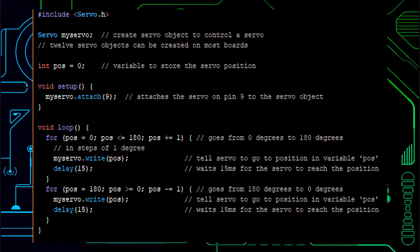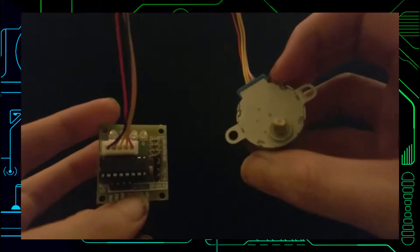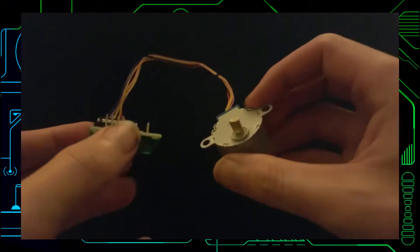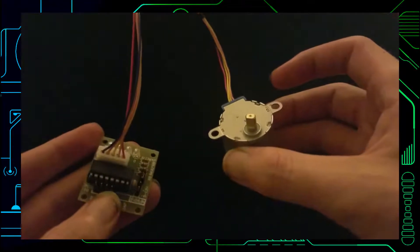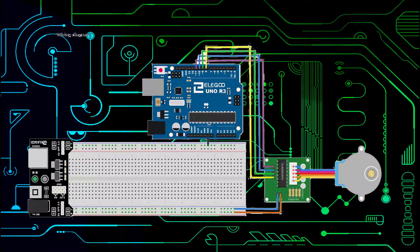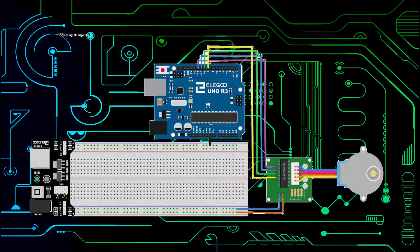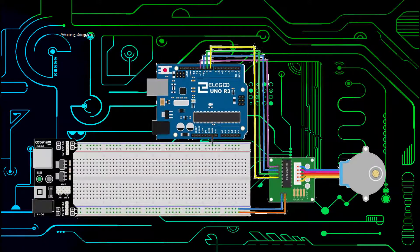The neutral position value is different with each servo motor. Stepper motors favor position like a servo motor, but they use a different technique. They utilize multiple toothed electromagnets arranged around a center gear. They require an external control circuit or microcontroller to energize these magnets at the right time. When one magnet is turned off, the next one is turned on and attracts the gear to the new position. Thus these motors have predefined step angles through a full 360 degree rotation.